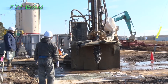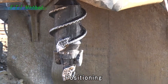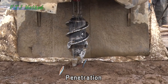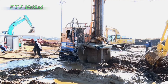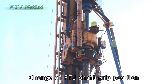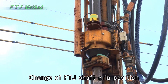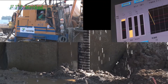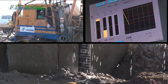First, the equipment is moved into position, and the tip of the mixing blades is placed at the center of the column. The shaft is rotated, and the mixing blades are driven into the ground. If the improvement is to reach a deep level, the grip on the shaft is changed. A system controller is used to check that the full depth has been reached.